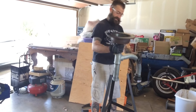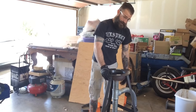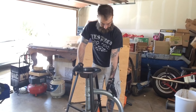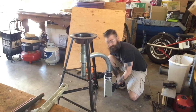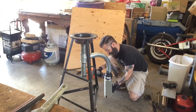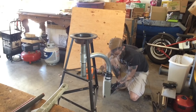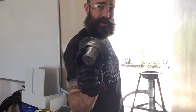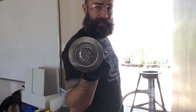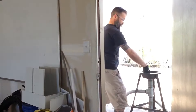Let's set it all together. This is still going to set on top just like I planned - all the components are sitting in there nice and snug. One thing about using the 90-degree elbow is I probably will want to make a stand to support it, because I don't want that tipping out. Our forge is almost complete now. Let's slip the bathroom fan on, a little hose clamp to secure it - torque it down enough to hold it but not too much to crush it, because it is a plastic piece. Seems nice and secure. One of the last things I'm going to do is put this screen - it's for a bathtub drain - over the inlet on the floor flange so that I don't have my charcoal falling through quite as easy.